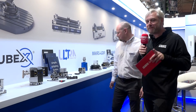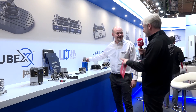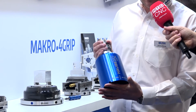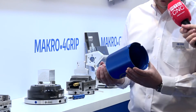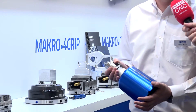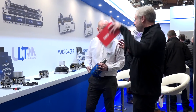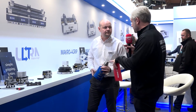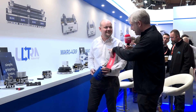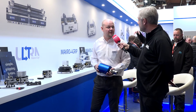Next product - there was a massive light bulb moment for me on this one. This is our newest product: it turns your tool changer into an automation system. With this workholding hood, you can effectively use your existing machine tool as an automation system. So if I've got a three-axis mill with a 24-tool carousel and I'm only using six tools, I can put these in the remaining 18 tool holders and automate that many parts - however many of these you've got in your tool carousel.